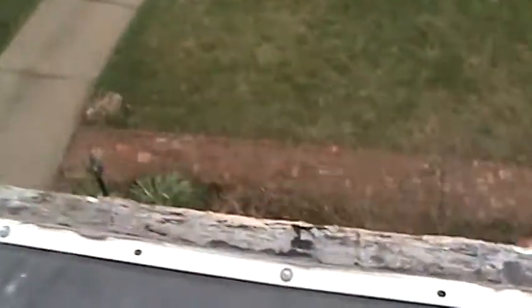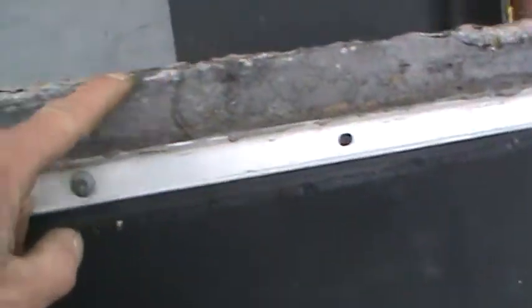There's a big pool in there. This leak up here is really in this window somewhere — I think over the dining room. You do have loose stucco right here where water can get in, and it would feed down and line up with this window. This is definitely the first area of stucco to repair.